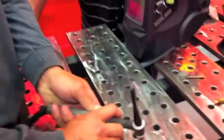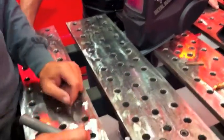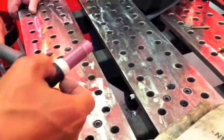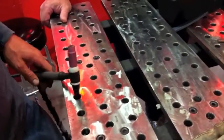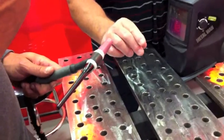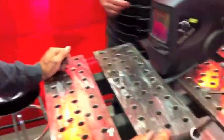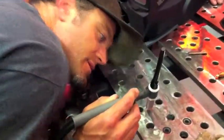If you keep accidentally touching the tip to the metal, push it in a little farther. And if you're way down in a crack or a tight area, stick it out a little farther. You adjust it by loosening the back cap — it takes the pressure off. Don't drive yourself crazy that the torch body is stopping you from seeing the weld. Get your head down where you can see it. A lot of people say they can't see — well, you gotta look at it.